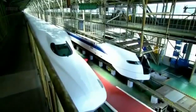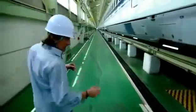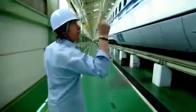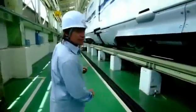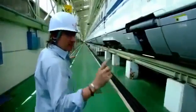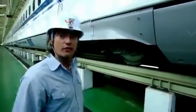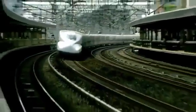The Japanese did exactly the same with the bullet train, flipping the traditional approach completely. Conventional trains use locomotives — big heavy powerhouses that pull or push the other carriages — but bullet train engineers turned that principle on its head. The pointy carriages at the front and back have no engines; instead all the other carriages do. It's called a multiple unit system, and on this train 14 of the 16 carriages have their own motors. Each motor drives two wheels, making it — by my reckoning — 112-wheel drive. Good traction without extra weight means it can accelerate suitably quickly, all thanks to a 19th-century 4x4.